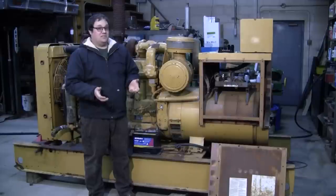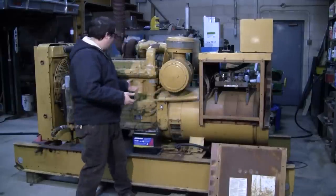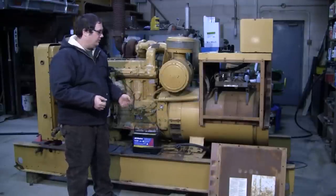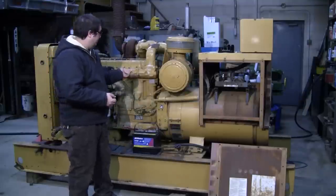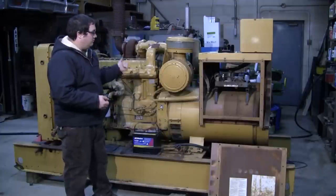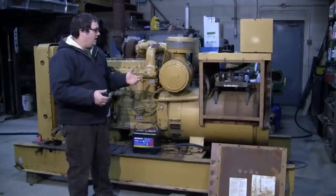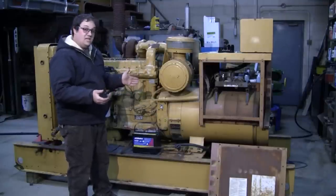It's been a little while since the last video, but I'm trying to get back into it. So what we have here today is, I believe, a 1981, so it's not all that old. Caterpillar genset, 135 kilowatt with the venerable 3306 engine. This is kind of a service call for a friend of a friend, but the unit, he bought it on the cheap. It didn't make any voltage.